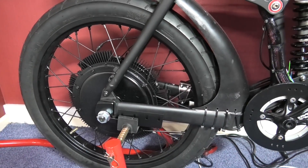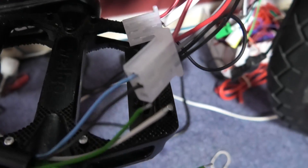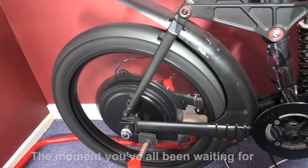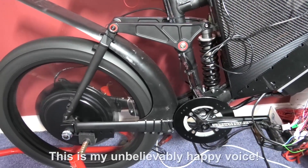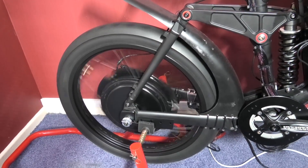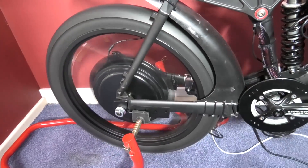I'll get back to my wiring. I'm going to put the throttle on now - well I've loosely wired the throttle very accurately. Just to try it out. I haven't got any regen, the throttle's not calibrated. I've still got to adjust it, I may have to add a resistor. But it's working!